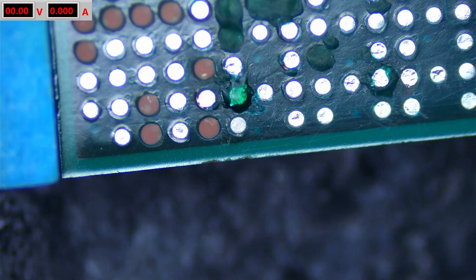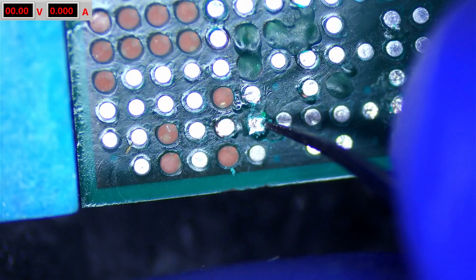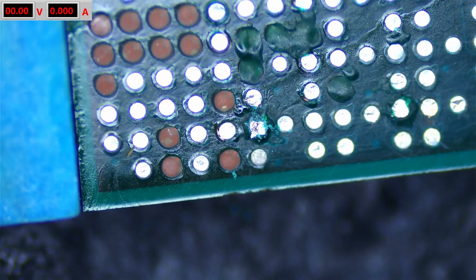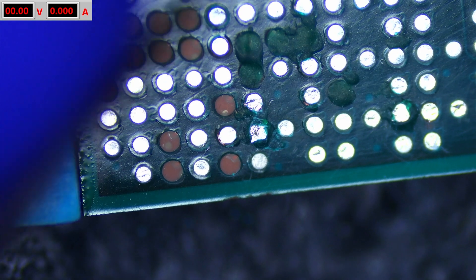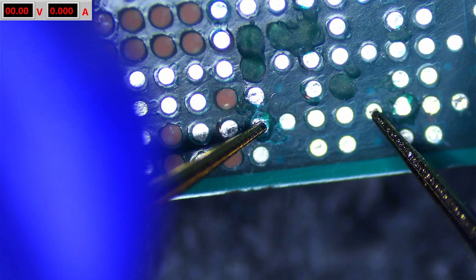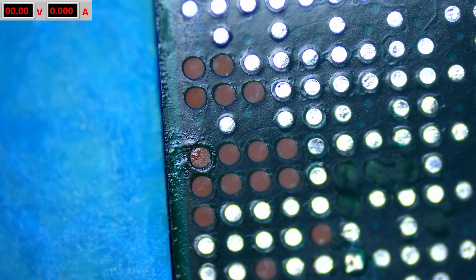Reline it up — I think that's soldered. Clean it off before adding more solder mask, trying not to ruin it this time. Let's cure that. Nice and cured, so let's get to scraping. That should be enough to get a solder ball on there. Double check with the multimeter that it is not shorting to ground at all — we'll go between known ground and our point. Yep, 0.5 voltage drop, so that's perfect.